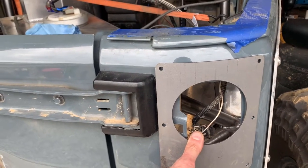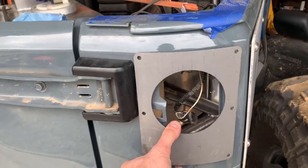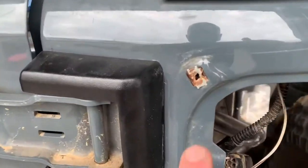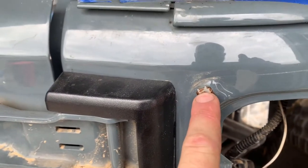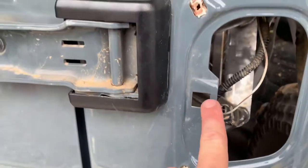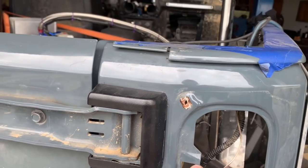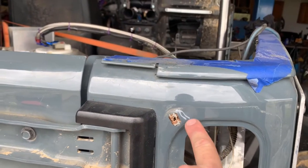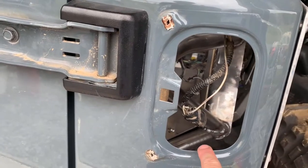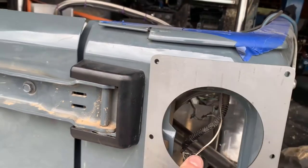And yeah, all that's really important to me is that they are symmetrical side to side, and they don't sit flush currently because if you look closely, where the old taillights used to screw in, it's elevated. So it's a bump out, and this is also going to be in the way of the light. So what I'll do here, or start off here, cutting minimally, is cut around that, come up here, something like that, right? We want to get that bump out of there so we can flush mount this.